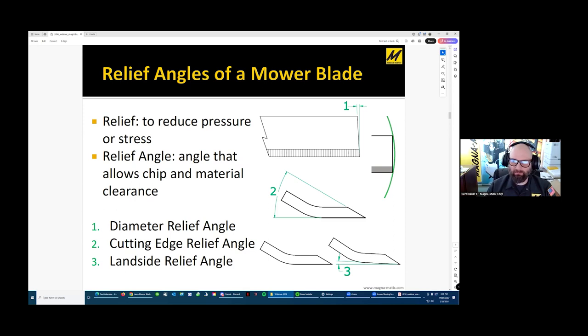The last angle is often in the deck pitch, though some blades have it bent into the blade itself. We can't have the underside of the lift hitting the grass you've already cut. So to summarize, the three relief angles serve three purposes: number one, we don't want to hit the grass that has yet to be cut; number two, the grass that has been cut needs to leave; and number three, let's not wreck the grass we've already cut. Those three surfaces come together to give you your pointed tooth.